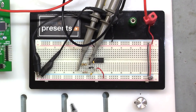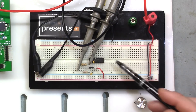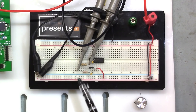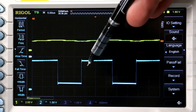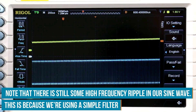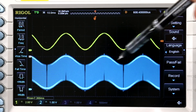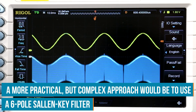Here is our breadboard circuit for our low-pass filter. We have a 0.1 microfarad capacitor and an 800-ohm resistor, which forms our RC single-pole filter running at about 2 kilohertz. There's also a bypass capacitor for the power supply, and the LM324 forms the buffer amplifier between our volume circuit and our filter elements. Trace one is the analog output and trace two is the pulse width modulated signal. Our filter does a pretty good job considering it's only a single pole and a simple RC filter — the sine wave starts to appear clearly at the output.